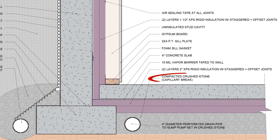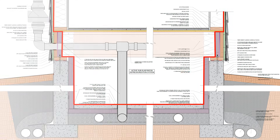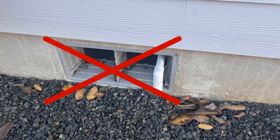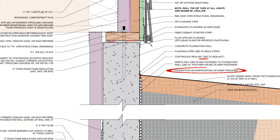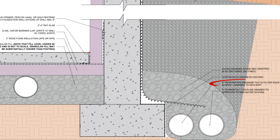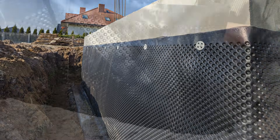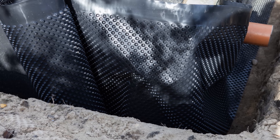You'll notice that this looks quite similar to a standard basement, minus the drywall or finishes, and that's because you want the crawlspace to be located within the interior pressure boundary. Now a conditioned crawlspace is not vented — it receives conditioned air from the interior, so no exterior crawlspace vents whatsoever. The exterior walls of the crawlspace are waterproofed and drained with a drainage mat down to a perimeter drainage tile that's set in a bed of crushed stone and wrapped in filter fabric, very similar to how we would address a basement. The drainage mat is important here because we want to alleviate hydrostatic pressure against those foundation walls.